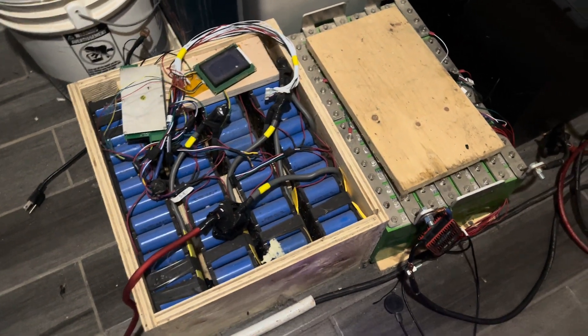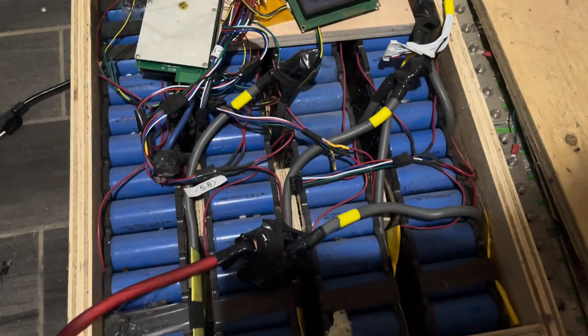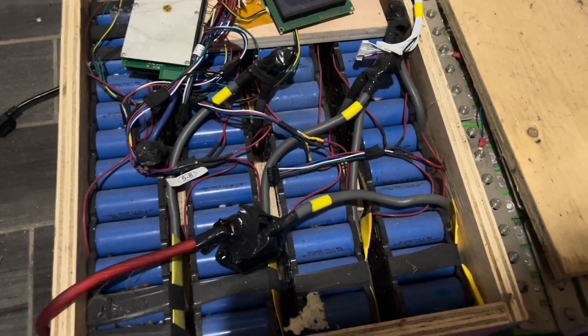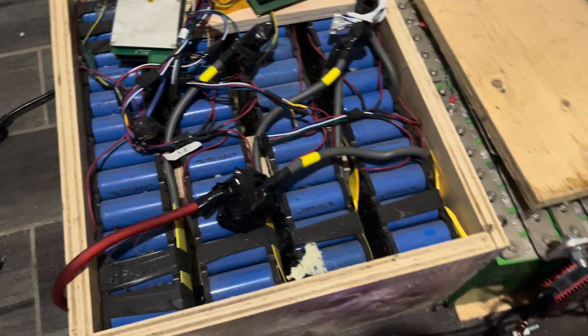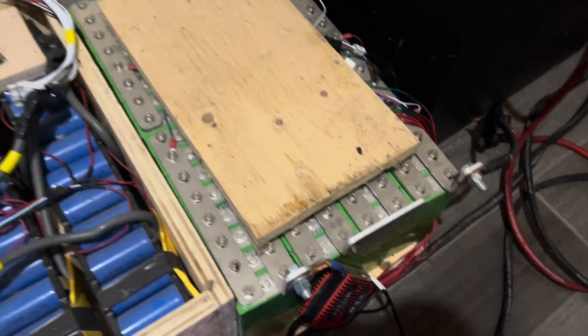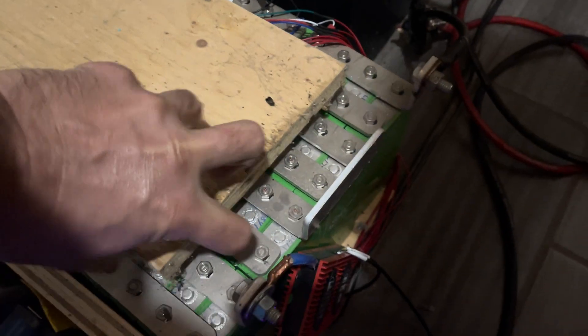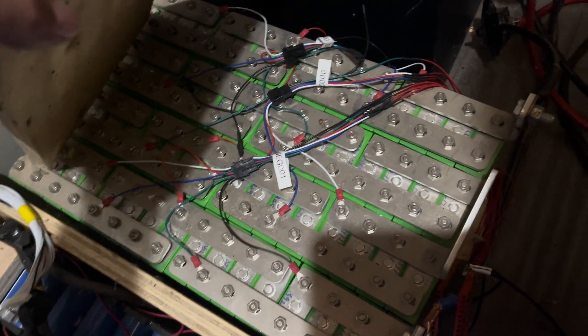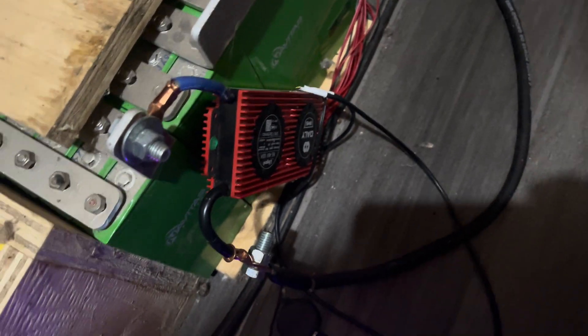These are the homemade homebrew batteries — cylindrical cells, LiFePO4, 48 volt. These are actually 90 amp-hour; I just said 100 for easy math. That one's prismatic and actually 100 amp-hour. I laser cut aluminum bus bars, screwed the thing together, and wires go off to a battery management system that controls the charge.